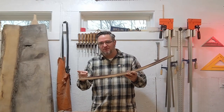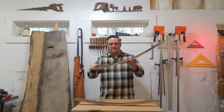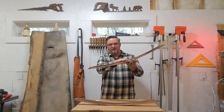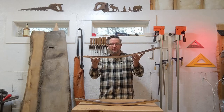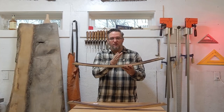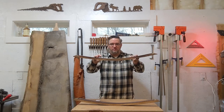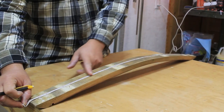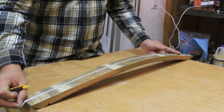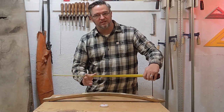To cut this down, I can't simply measure over 12 and a half inches from each side and cut a chunk off. That won't work — I'd have a weird flat spot and then a curve at the end. Barrel staves are always curved more in the middle than at each side. So to cut the 12 and a half inches, I'll first need to find the exact center and measure out from there. That's where this flexible measuring tape really comes in handy — it lets me get an accurate measurement across the curve of the barrel stave, which is hard to do with a traditional tape measure.